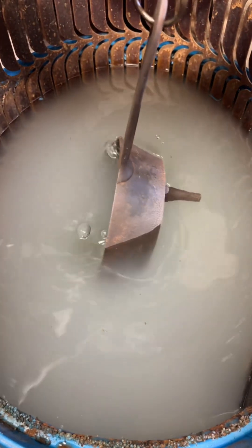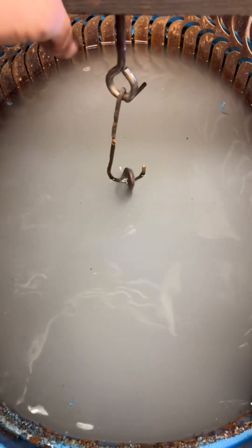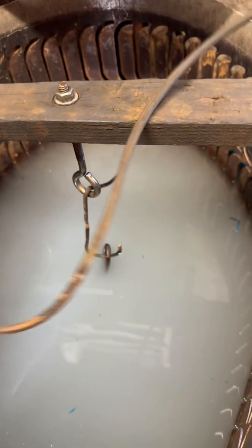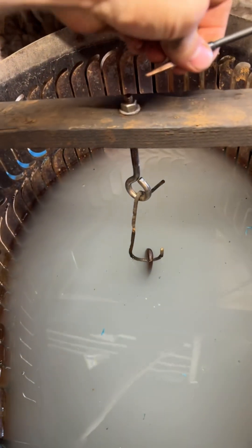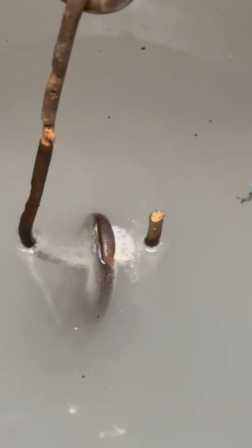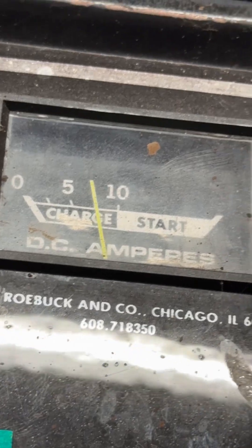Here's the maiden voyage. After we got her cleaned, we're going to put a spider skillet down in there. You just want to make sure whatever you're suspending does not touch the anode on any side. Then you're going to hook up your positive cable on the anode and your negative cable right here. You'll immediately see bubbles starting — that is a good sign. That means your electrolysis tank is pulling current and working correctly. About a seven and a half to eight amp draw — that's all you need for an electrolysis tank.